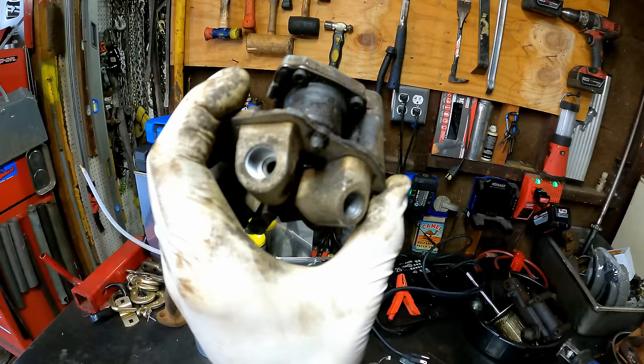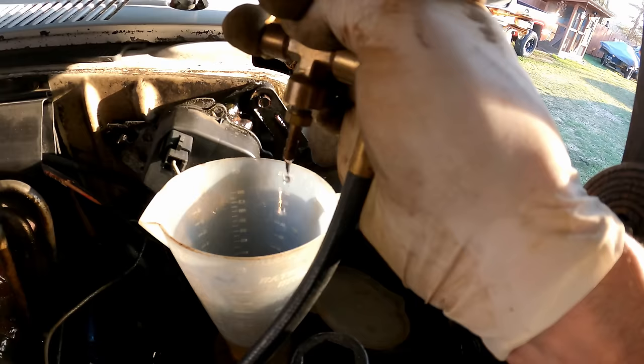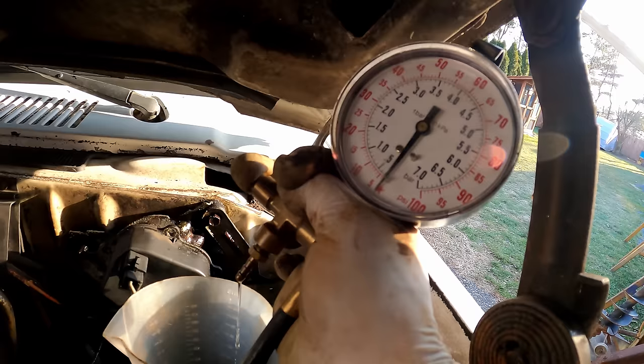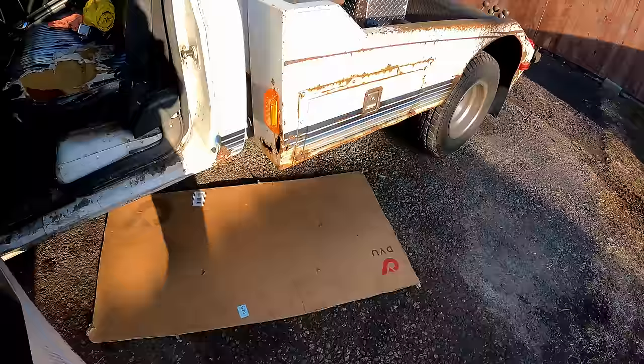This is the regulator right there, and the inlet on this side. I wanted to clean this up anyway, but with it off there's plenty of room to get in there with a fuel pressure gauge. Here's what I found — I'm not getting much flow out of it, although it does build up pressure; it takes a while though, even with the lines purged. Up to 20 psi — that's pretty good because TBI only needs like 10 to 15 — but that just seems like really, really low flow. I'm feeling like we have a restriction, or more than likely a bad aftermarket pump, because I did get the cheapest one available when I put it in.